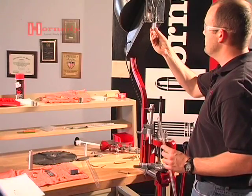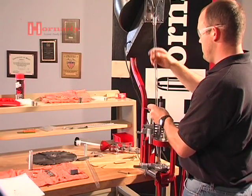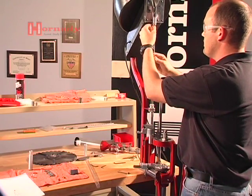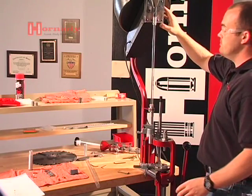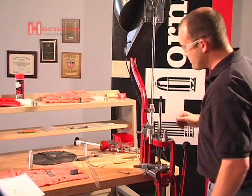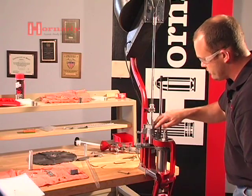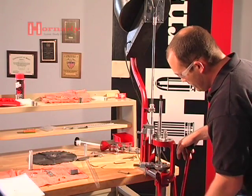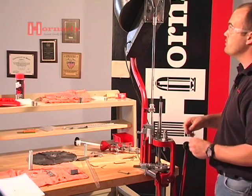When using a small feed tube, you need to use this bushing so that everything fits properly into the case feeder motor assembly. We're going to start with the plastic tube and the bottom bushing, and then raise that up into the case hopper motor assembly bushing. When the ram comes up, it's contacting the rod, and the rod is rotating the shuttle. The shuttle will feed the case down to the subplate, and we adjusted the caddy so it locates the cartridge case properly in the shell plate.